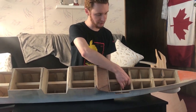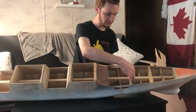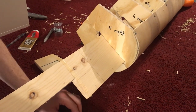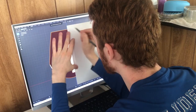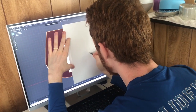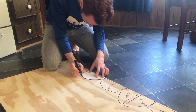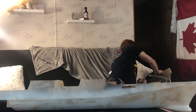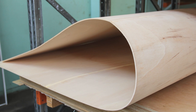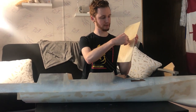Here is a piece of hardwood that's about an inch wide, and within it I have pieces of plywood here, here, and here to give curvature to the hull. I was able to make them by tracing the shape of my 3D model on the screen. This model was made on the computer first so I could tell exactly what dimensions it would have. I bought what's called flexible plywood - it has two layers, one hardwood and one softwood.